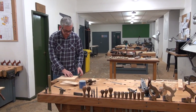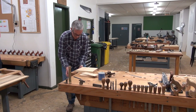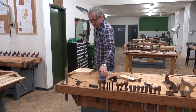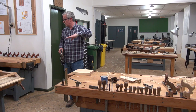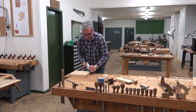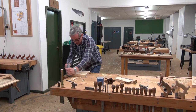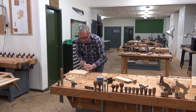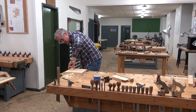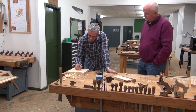So I've got a mark to plane down to. It's a similar process to when we were planing down to our winding sticks — we're doing the same thing with the plane, but how we check the cut is different. We're taking shavings off sideways, and I'm watching for feathering here. Can you see as I get down to that cut? Basically what I've got is the side of the timber — I've put the gauge line there and I'm planing down to that cut.